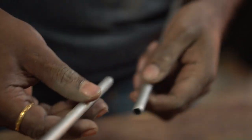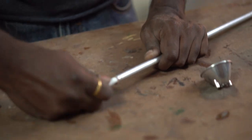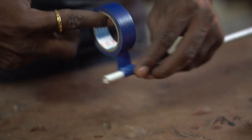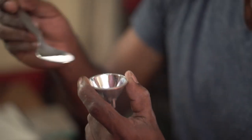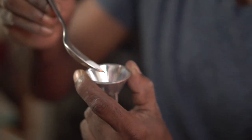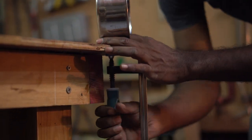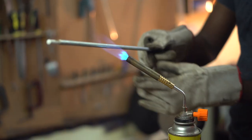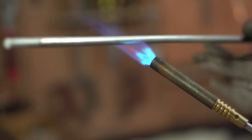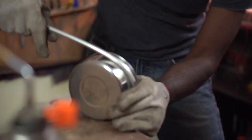The holes of this pipe have to be plugged and a pencil seems to fit snug into this hole. One end of the pipe is plugged with the pencil and I wrapped it with sticky tape to keep it secure. Then using an improvised funnel the tube is filled with table salt. Once it was packed tightly the other end of the pipe was plugged as well. I clamped a kitchen container on the table as a reference and support to bend the tube. The tube can be bent as is, but heating the tube reduces the stress on the metal. Using the steel container as a support, the tube was bent while it was still hot.